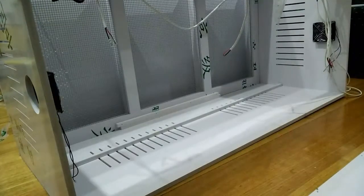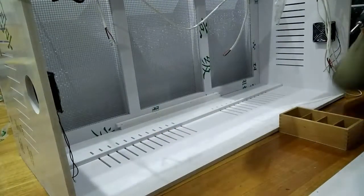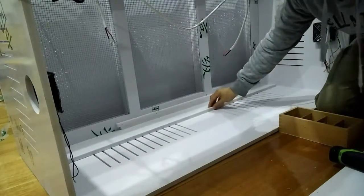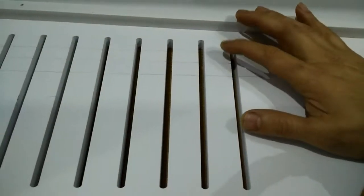That's good. Get my cordless drill. Screws. What we're doing is putting this in the right position. Now, back to here again. Underneath, remember the line that we scribed? That's the top line. I scribed that just for you to measure, to make sure that the top line that you scribed and the other two lines that were already pre-scribed from the factory match. So there's a gap. In fact, you don't really have to scribe the top line. Just follow that in there. The ones that are doubled, the bottom, because that's the bottom, and place this rail in there and fasten it.